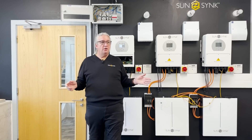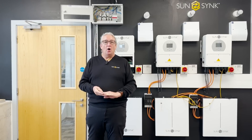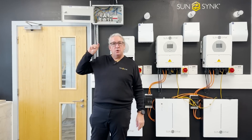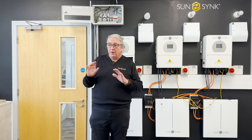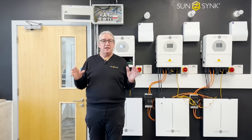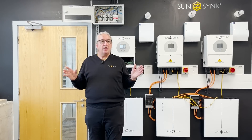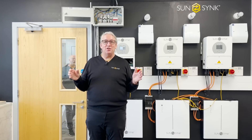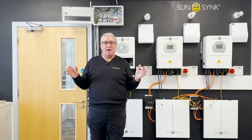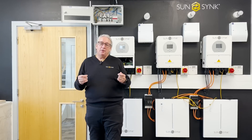So if you've wired the units up and they're tripping your RCD, first of all unwire it and wire the AC to a different point. If you're not sure on the install, please consult a qualified electrical engineer and they'll help you find the problem. But it's not the equipment — I've had this many, many times and it's never the equipment, never our gear. It comes with the territory and we try to help people, but at the end of the day it is an issue.